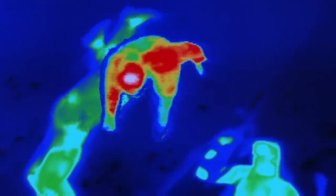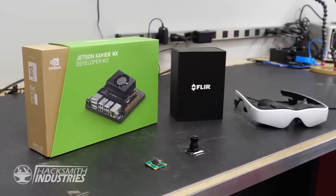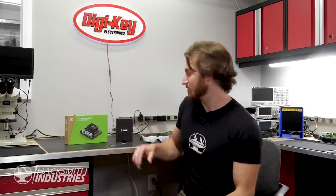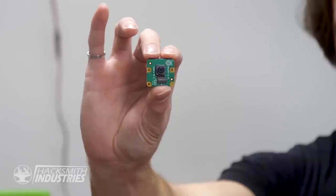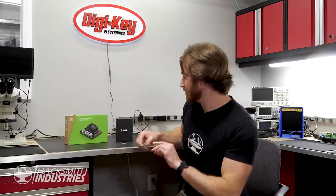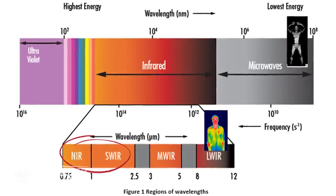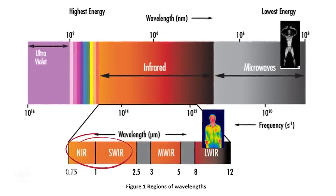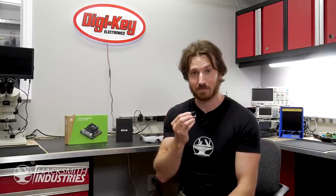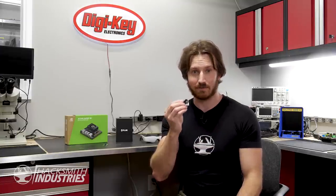How are we going to give the helmet the ability to see in multiple spectrums of light, just like in the movie? By using a digital camera sensor, we can see things the human eye cannot. We're using three different camera modules. The first is a standard Raspberry Pi 8-megapixel sensor that can capture 1080p images at 60fps. The second is the same sensor but missing an infrared filter, so it can capture shortwave infrared light and see in the dark — we'll add a visible light filter so only IR light passes through.